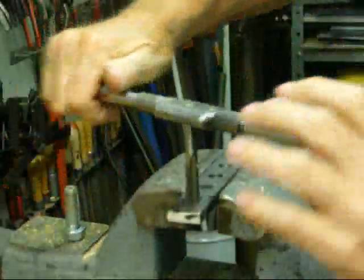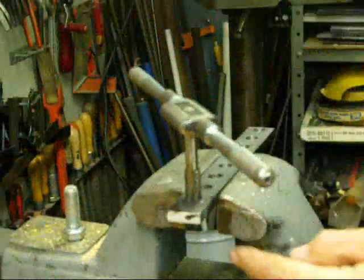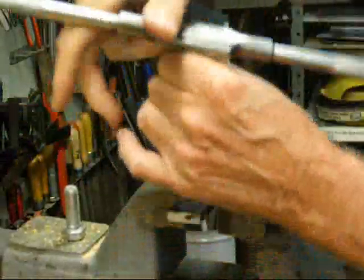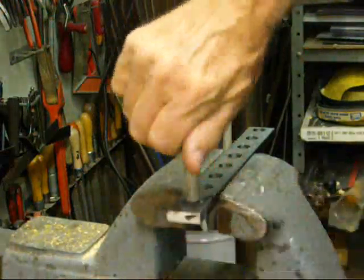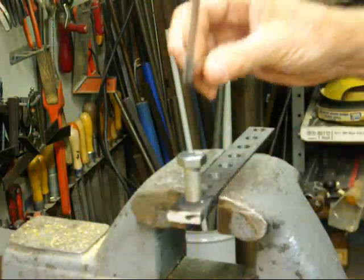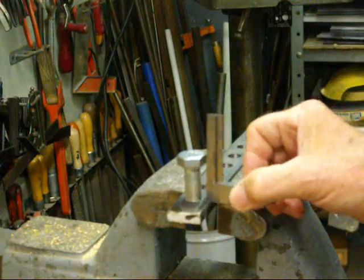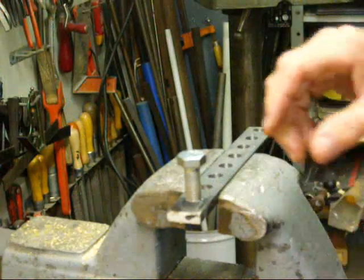Always back it up. We don't have to go all the way down, but we have to go down far enough so that we overcome the seven tapered teeth. Now we're pretty much all the way through as I'm running it in, and then I can back it out. We'll check it with a bolt of the appropriate size and it threads in nicely. You could stick the tap back in there and check it for squareness in two directions — that's the proof that you're going straight, or nearly straight.